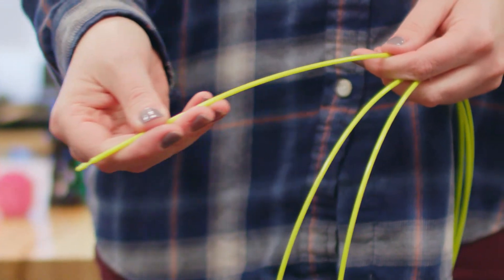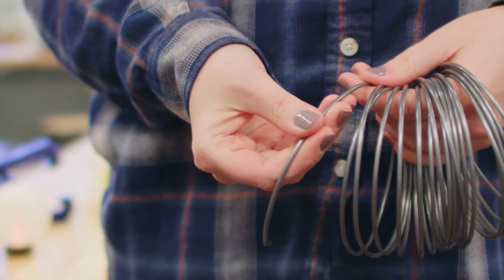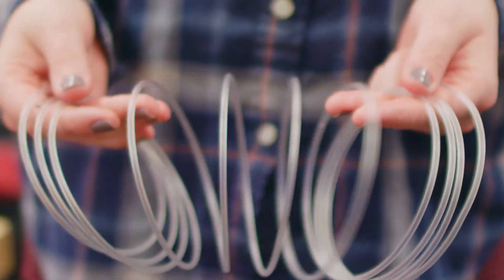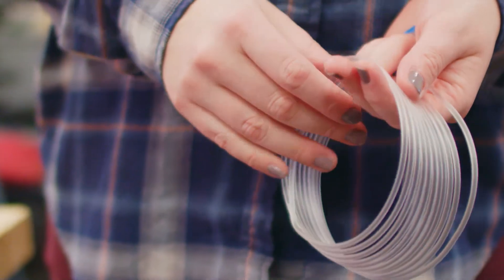PLA is made from corn and is the easiest filament to start printing with. Objects made from this filament are best used indoors. ABS is another type of filament — it's more durable and stronger than PLA, but requires more experience. PETG is just about as durable as ABS and is great for outdoor uses. The cool thing about PETG is it allows us to print clear, but it also takes more experience to print with. Buying good filament is important, so please come talk to us at the makerspace before purchasing any filament.